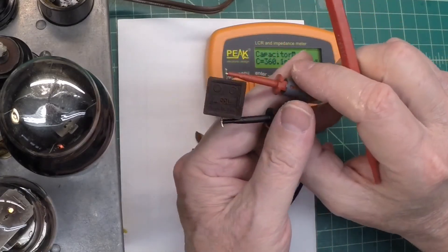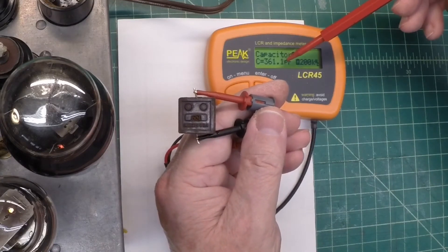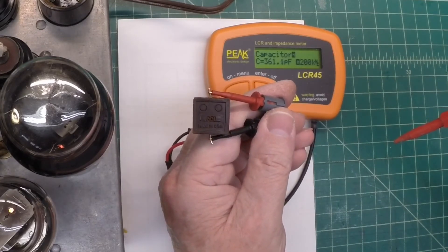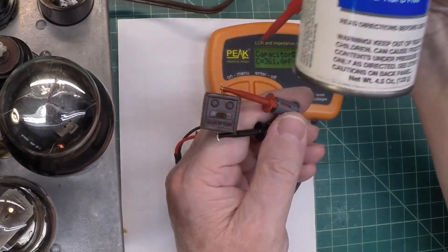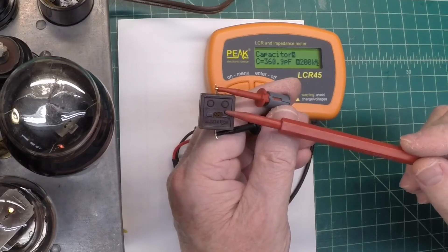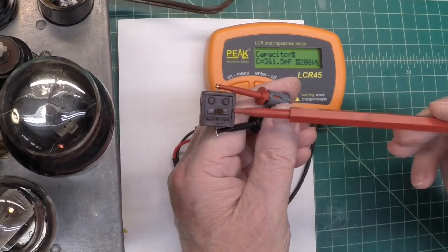Here's this bizarre — we'll call it a mica capacitor, though it actually may be a paper cap. You can see the results here on the meter right now. A minute ago I was down in the 200 picofarad range; now I'm at 361. This thing should be rated around 1000 picofarads, so it's way out of spec. And it changes, which you can see just by applying a little bit of heat. Using some component cooler, I was able to quickly identify the defective cap. While I was in there, there was another cap on that same oscillator side for the broadcast band — a 500 picofarad — and I went ahead and replaced it as well.